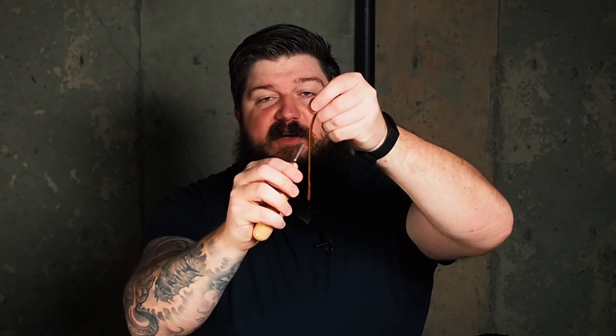Those aren't the only tools that you can strop — you can strop pretty much anything that cuts or pierces leather. Those are just the ones that I strop on the big strop. You can also strop tools like your French edger by just cutting a small piece of leather that actually fits in the groove there, then doing it the same way, making sure it stays inside the groove. Same thing with your edge beveler — I have a piece of string attached to my workbench, I rub Jeweler's Rouge on it and then strop it along the string. Works great. You can buy one of those plate things too if you want to sharpen those, but I haven't found a need to — string works just fine.